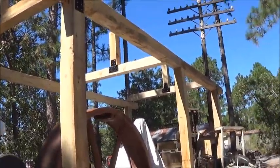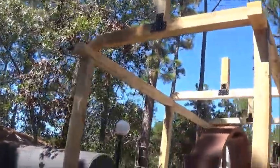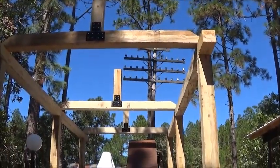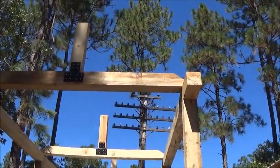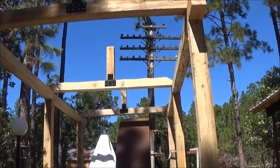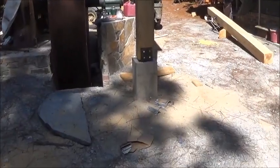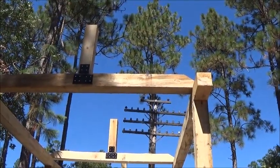Working away on a Sunday, kind of working by myself today. I've got three uprights on now. I've got to run two beams long ways and then we can start joining the rafters up to it, cutting them and getting them ready. It's slow but it's coming along. We ended up going with a 10-foot wall, so we've got about a foot and a half, meaning it's about 12 feet to the bottom of this cross beam.